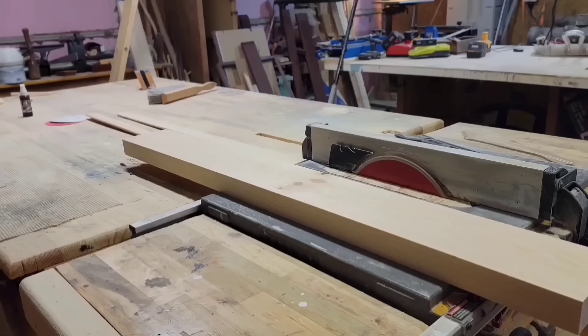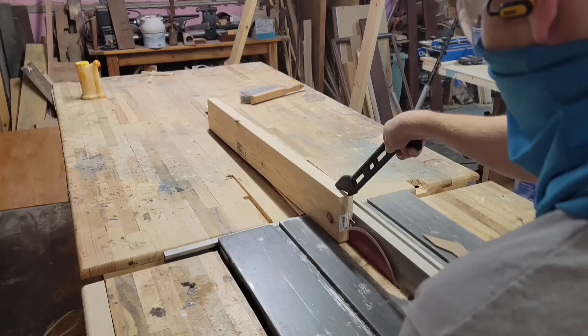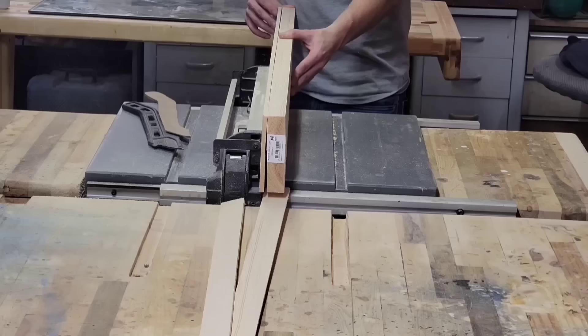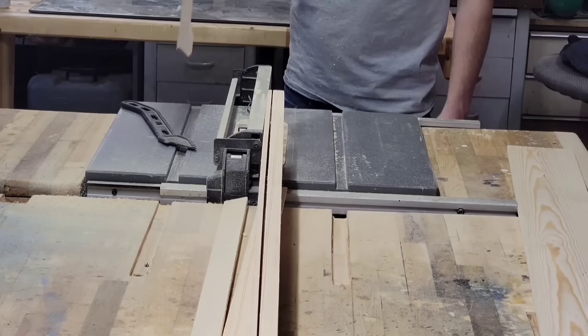With what is left of the 2x6, I am going to re-saw it into two quarter-inch boards and one three-quarter-inch board. I always re-saw on the table saw, but preferably if you had a good band saw that would be a lot better, especially with wider boards like this. I have to do it in two passes on the table saw because my blade doesn't go high enough, and then it leaves a ridge down the middle, which I can just sand down. But with a band saw it would probably leave a nicer face and be safer, so use a band saw if you can.